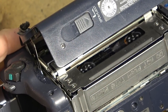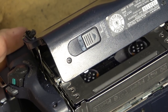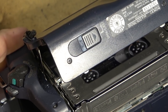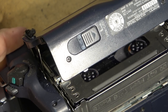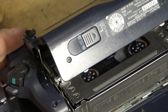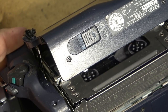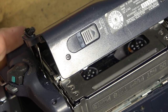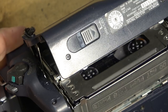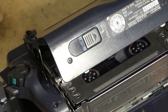And in case you guys are curious, in Digital 8, the tape moves pretty good. Twice as fast as 8mm and Hi8. As you can see, that tape's trucking along there pretty good. So this 60-minute tape plays in 30. I'm going to let this thing play a few more times before shipping it back, but everything at this point looks good. It's gone through this tape now 3 times. And this is one of these HMPX tapes, which are not my favorite tapes as far as it was the professional tapes.